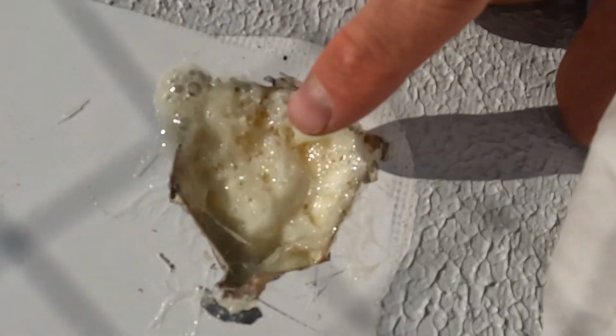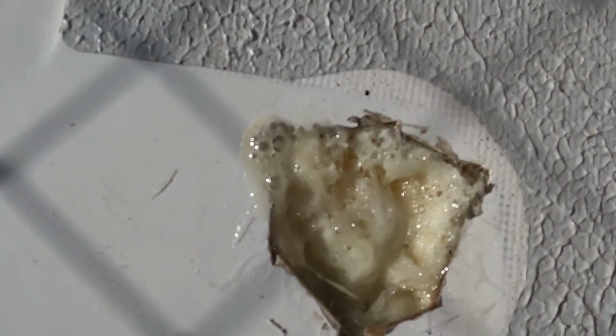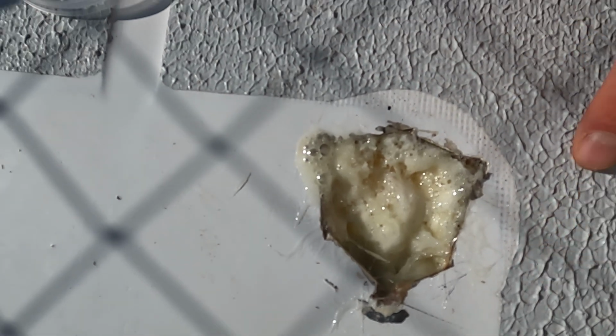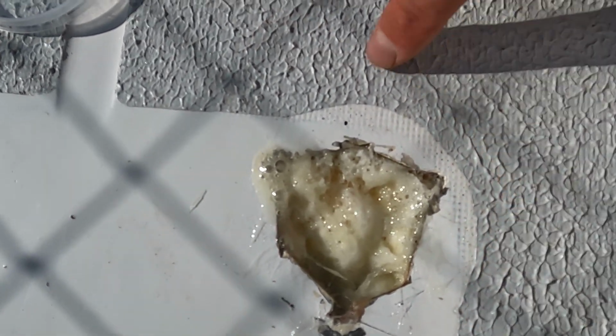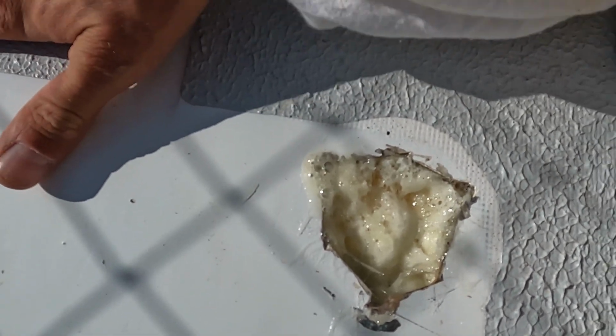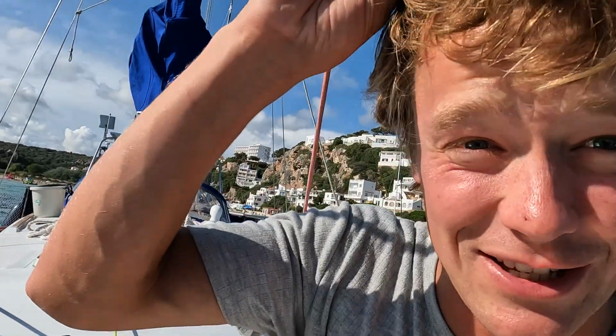But also it's just a really big batch of epoxy, so it's creating its own heat, which is speeding up the process, like it's an exothermic reaction. So anyway, it's curing very quickly, and it's not ideal because it's basically bubbling. This is our epoxy, and it's started to slow down now, but all of this around here, where it has filled the void, this is hot, but not too hot. I can touch it. So at least the epoxy is cured.